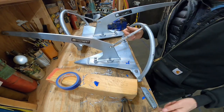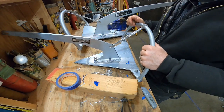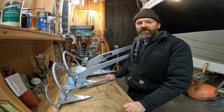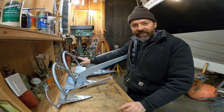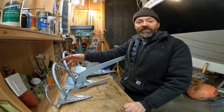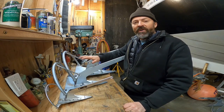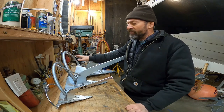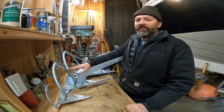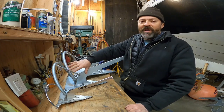Tight as a drum, and it's very low stretch. I cannot see this roll bar bending at any conceivable loads you would put on this anchor. I want to stress that by adding this strap I am not saying that Mantis anchors are not strong enough - I'm saying I need this strap to continue my ultimate holding power testing. It's very possible that most or even all normal users don't need this. You're welcome to try it, but I'd wait until we complete testing to make sure the strap doesn't somehow affect performance.